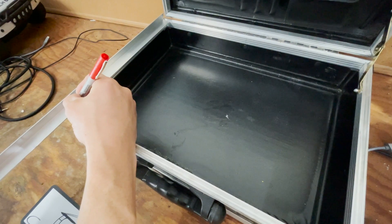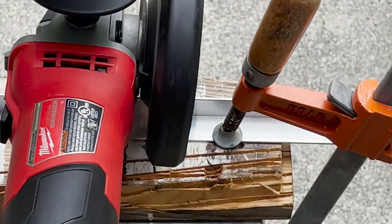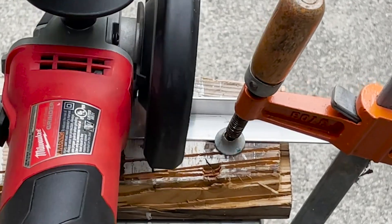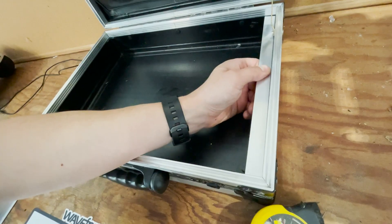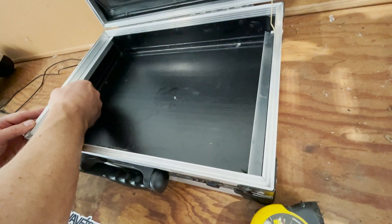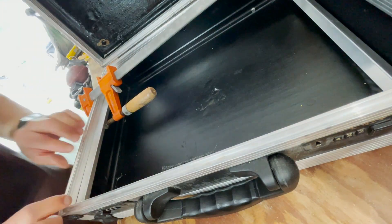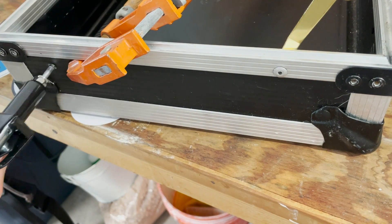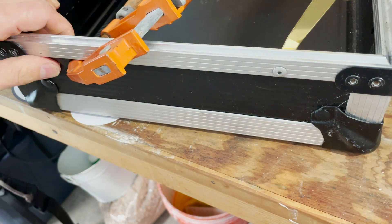The first thing I did was get some lightweight aluminum angle from Home Depot to make a ledger for the false floor. After marking my length, I went after it with an angle grinder. Then I took a minute to polish the ends of that aluminum and make sure all the burrs were removed. After I made sure they were the right length and polished on the ends, I started the process of riveting them to the inside of the case. The only thing I wish I'd have done differently was to put some washers on the outside of the case with the rivets.